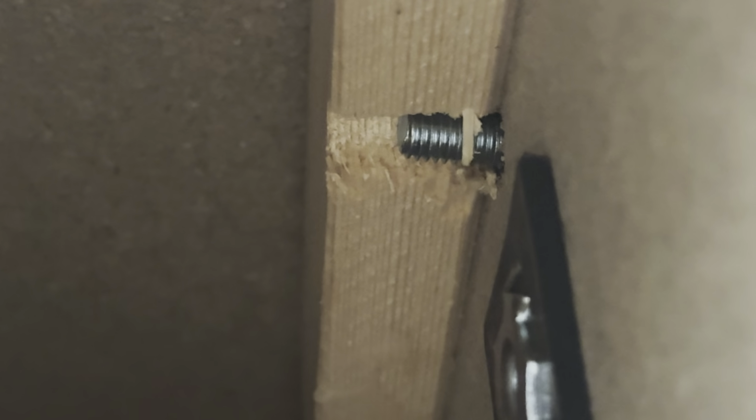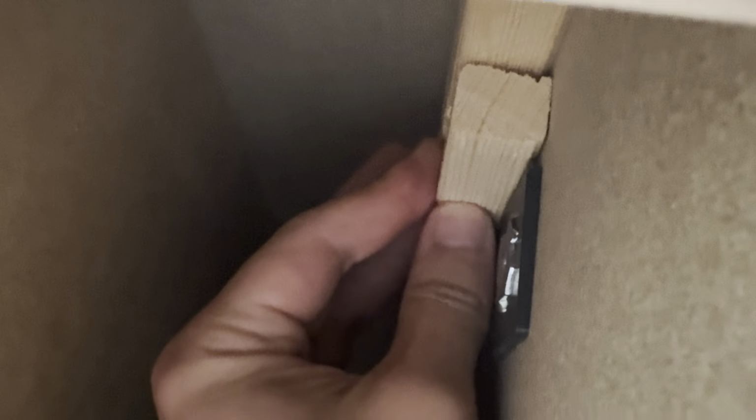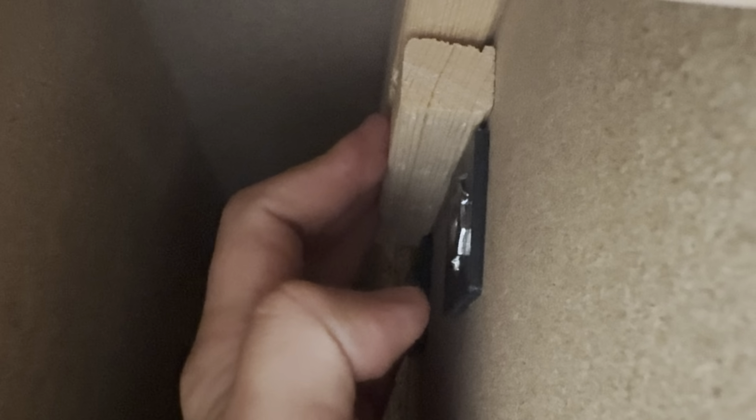But obviously, you're thinking that when you put a bolt on that, it's going to be lopsided because, you know, one side's thicker, one side's in the air. So the plan is to actually put just a bit of super glue. Get this camera right. A bit of super glue. Just put another piece of wood there that was scrapped from when we cut off the arm, and that way we can clamp on top of there, and everything's nice and even. And just the other side of the bolt, honky dory.